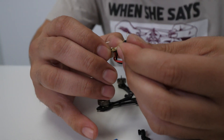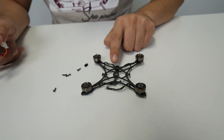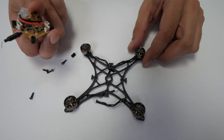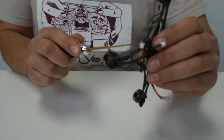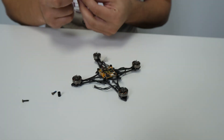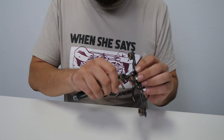Here's the FC — you want it with the bigger zone on the bottom for now. There's also a front and a back to the frame; this is the back. You'll notice it lines up with the USB port, so make sure you put the USB port in the back. We actually make the screw able to just screw straight into the carbon fiber — carbon fiber acts as your retaining screw. With something this small and this light it works better than a press nut. Not with this size anyway.